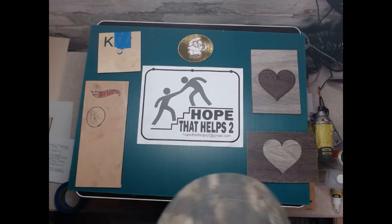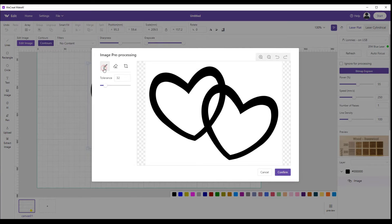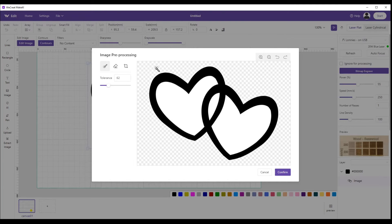This section is for inlays that go all the way through. I've called up an image on screen — you'll notice the white area around the outside is just a basic bitmap. We're going to be dealing with contours. If we hit contours right now we'd get a square, which isn't useful, so we need to get the contours of the hearts — only the exterior contours. We hit Edit > Image Magic paintbrush and click on the outside of the hearts to remove it.